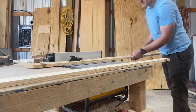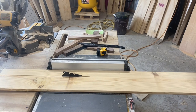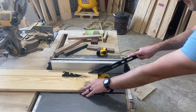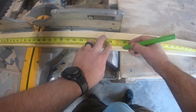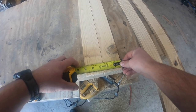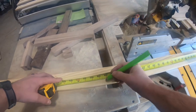If your door is much wider than that, you might find that you need 4 of these. First, let's cut 2 of these to the height of our opening minus 1 inch. To get our width, let's take the width of our opening, subtract the width of 2 of these boards and a half an inch. We're going to be cutting out 3 of these pieces.